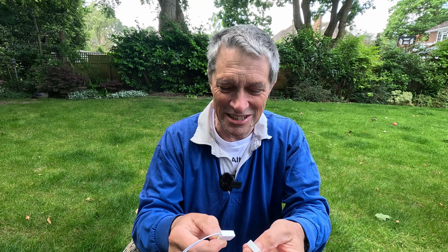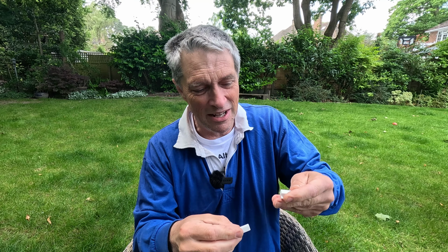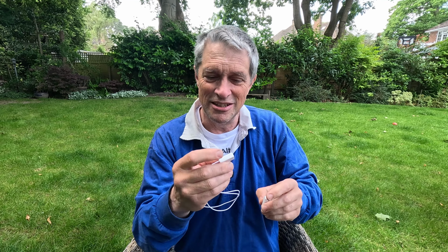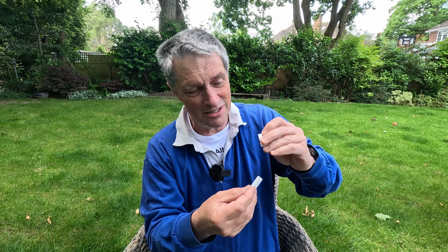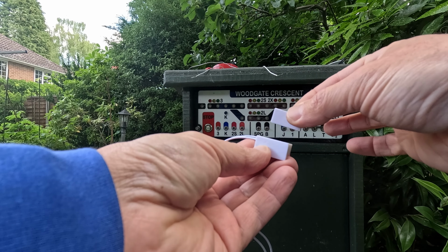I'm not going to go into the full details of how the system uses these, not in this video. Do check out other videos in the playlist. But basically, these are mounted along the track and coupled up to the system that I've developed. Underneath the locos of each train, there are these fixed magnets. So these are reed switches, these are fixed magnets, and as the train passes, the sensor detects the position of the train and sends a signal back to the system. However, if any of these don't work, then it's a problem for the DLC system.